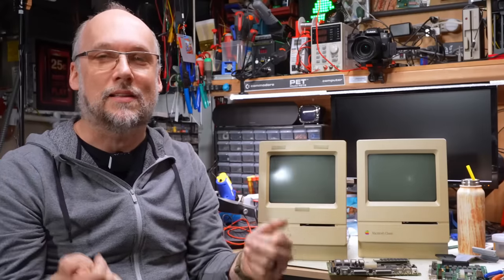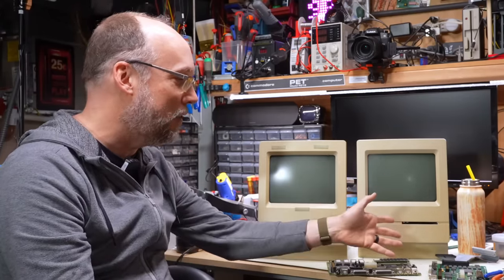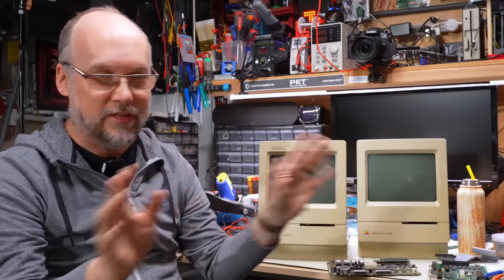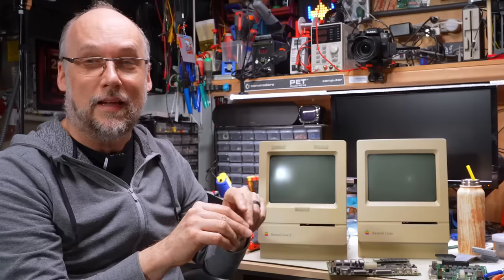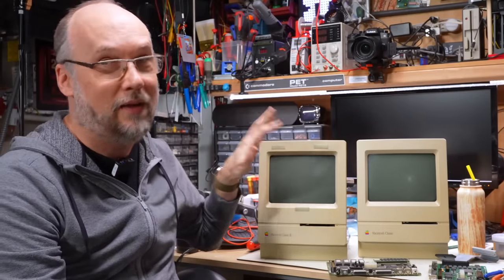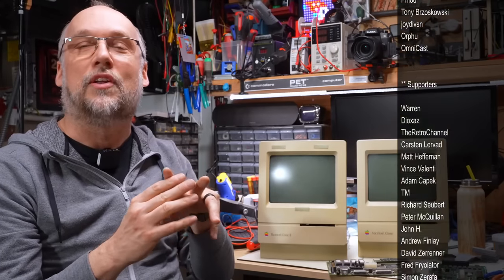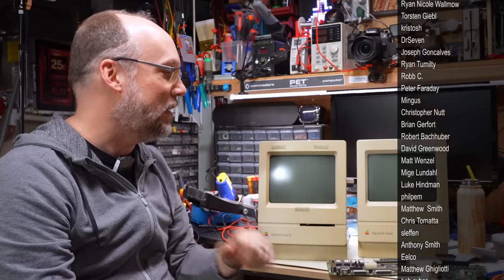Anyhow, I think that's gonna be that. So hopefully you enjoyed this video. I hope people found it helpful about how I go ahead and recap these particular machines. I wanted to show that with the power supply especially, I really don't recommend a blanket recap of every single thing on there. There were a lot of caps we didn't touch. Just focus on the ones that are the bad ones. And it's always those brown ones that are the problem. So deal with those on your Classic. Even if you haven't before, I'd recommend you do it because it's probably gonna leak eventually. And then in combination with the recapped motherboard, you should have a nice, long-lived, hopefully reliable Macintosh machine.